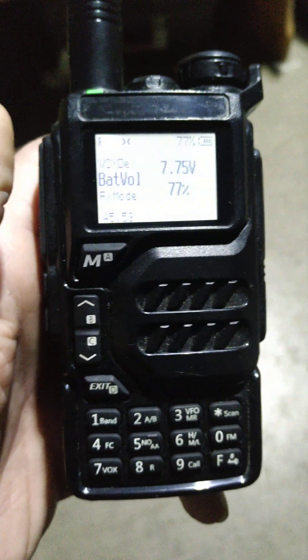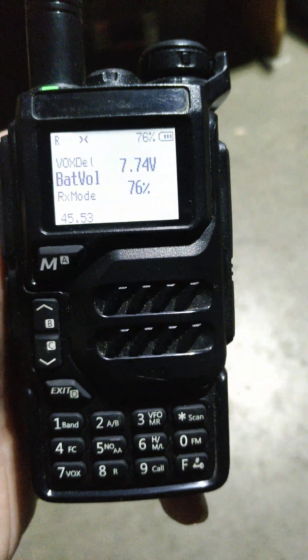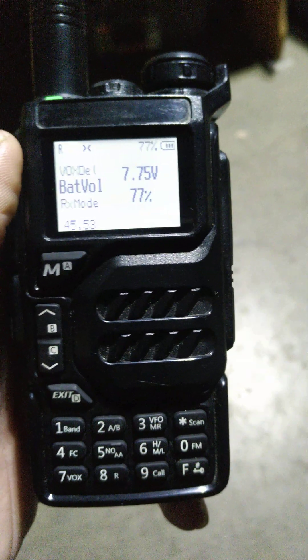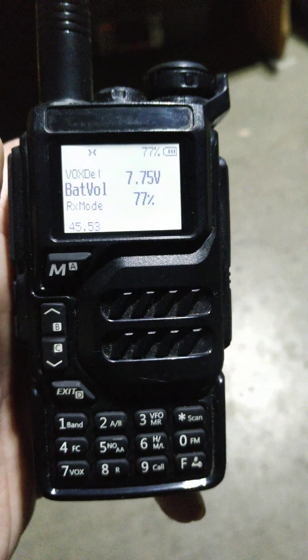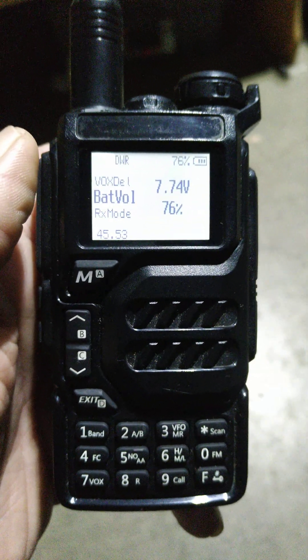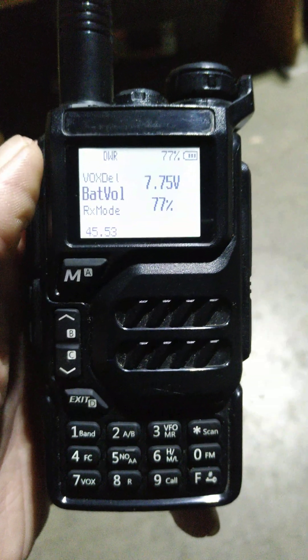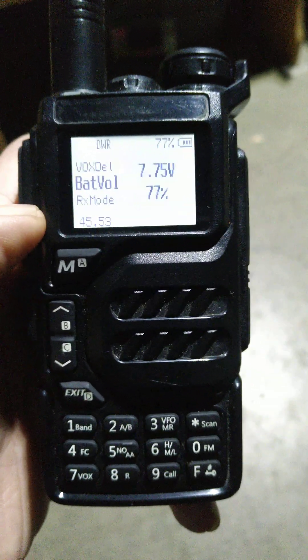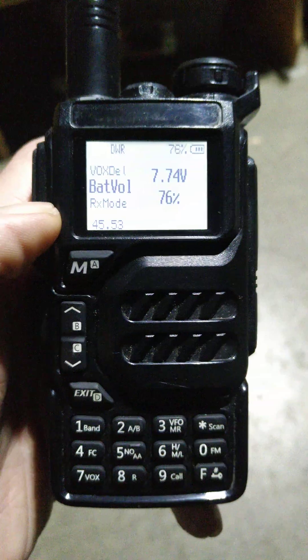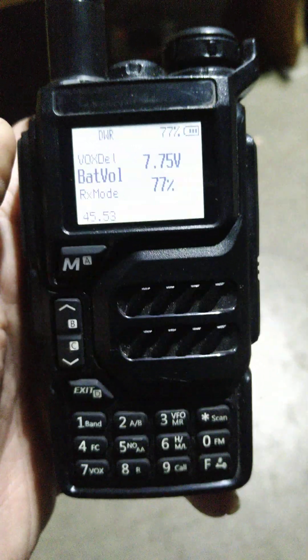Again, this is the Nunu version 20.5 — there are a lot of other firmwares out there. The radio works excellent on 2 meter, 70 centimeter, and GMRS. It actually has quite good harmonics on the 1.25 meter band as well, so you could say this is a quad band radio for TX and RX. However, the other bands I would not recommend transmitting on with this firmware — you cannot.